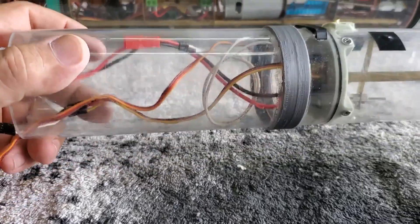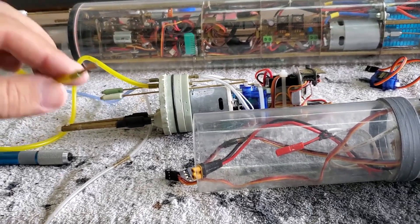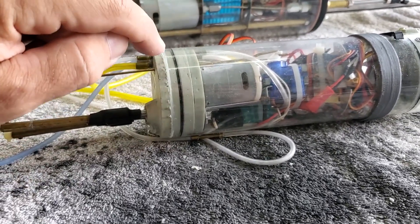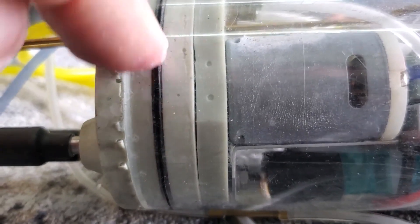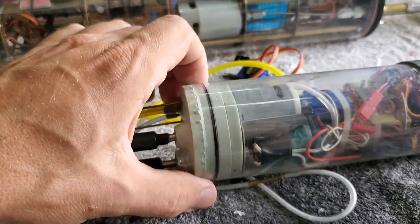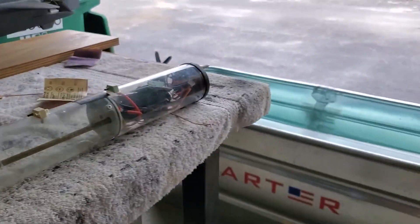Now we need to see what kind of job we did. I'm going to reassemble the cylinder and use our testing hose to blow into it, pressurize the cylinder, and look for bubbles. Just before throwing it in the test tank, I want to show you the ideal seal pressure — you can see a dark ring around the outside where the seal is being pressed into the cylinder interface. Spin it around and make sure that ring is equal all the way around the perimeter, and you should have a good seal.